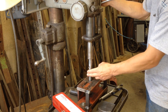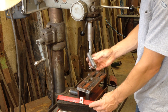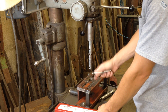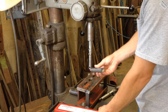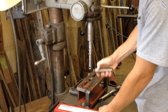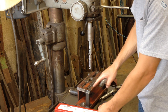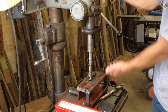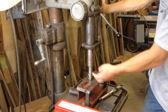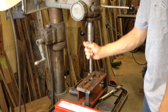I made a little extension for it so the bearing takes most of the load and takes pressure off the spindle. This boring bar did come with an extension, but I find it way too long — it hits the drill press table even with this little fixture. So I just get the table lined up and locked down with the boring bar in there so I know I'm on the bearing correctly, and then I take this thing out.